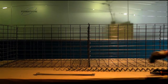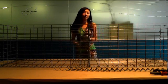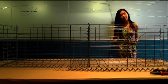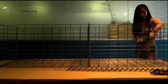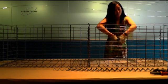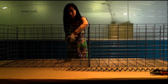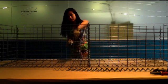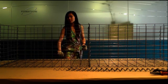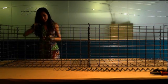The next step is very important — we need to put the stiffeners in. For this cage, we use four stiffeners and we place the stiffeners across the cage evenly, roughly five apertures down in the middle. The use of stiffeners is to prevent the cage from bulging once you put the rocks in. So it's pretty important.